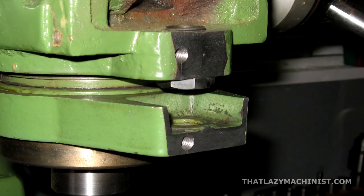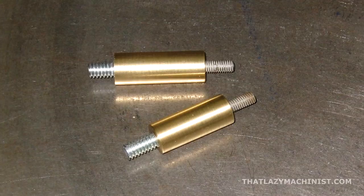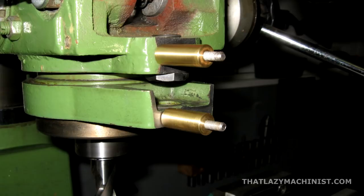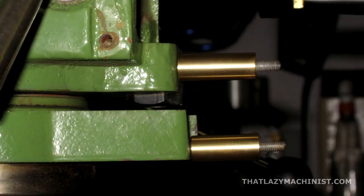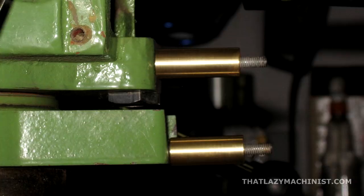On the lathe I produced two brass cylinders, threaded on each end — one end 1/4-20, the other end 10-32 — and I've inserted threaded rods cut to length into those threads. Note that I produced the brass cylinders at two different lengths in order to compensate for the fact that the flat surfaces I produced are not in the same plane. Also note that the brass cylinders are a lot longer than they would seem to need to be — that is in order to clear the plastic cowling once it's reassembled on the casting.